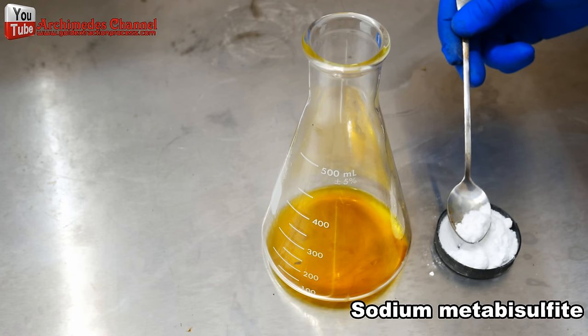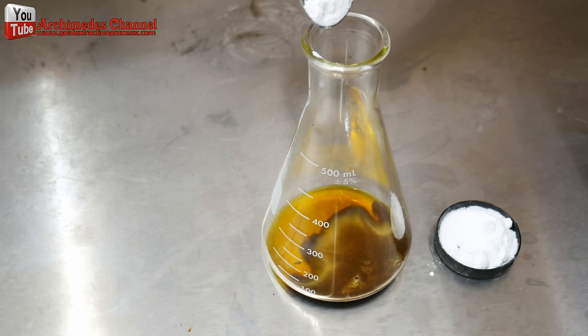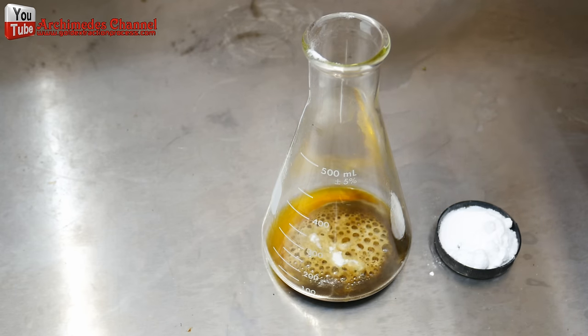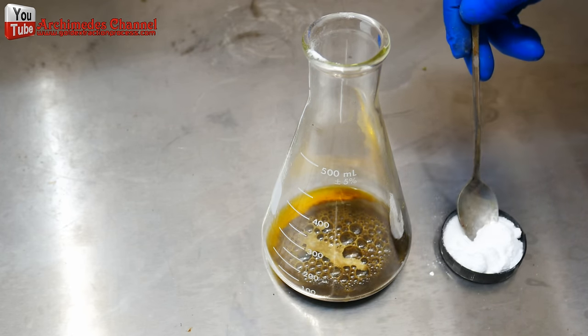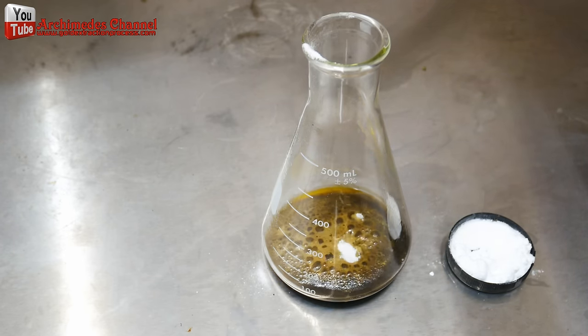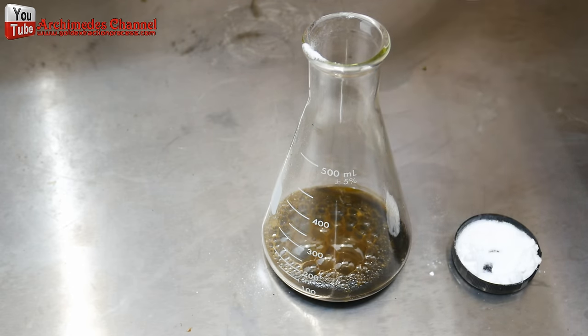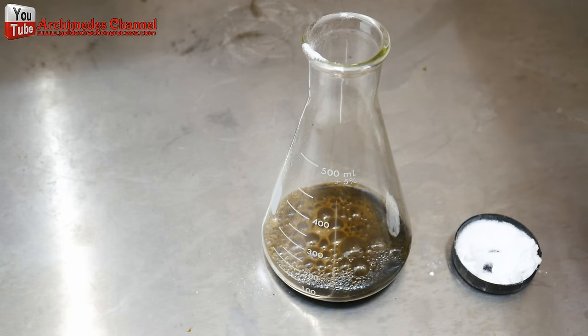Pure gold precipitation produced by the aqua regia chemical refining process. Aqua regia is primarily used to produce chloroauric acid, the electrolyte in the Wohlwill process for refining the highest quality 99.999% gold.